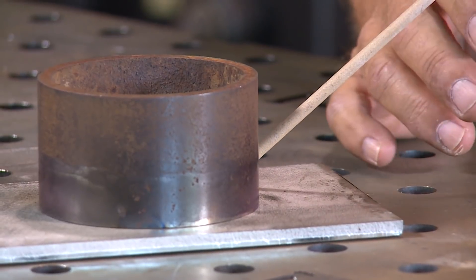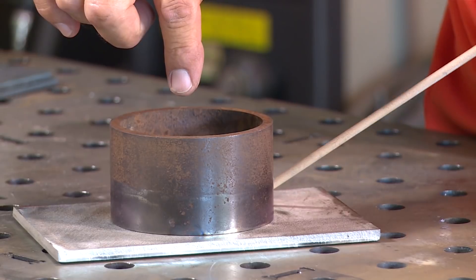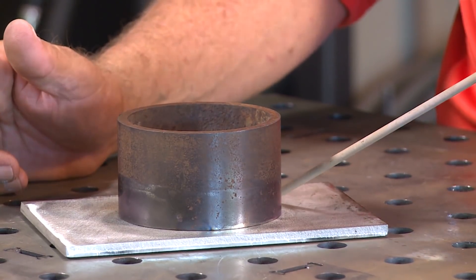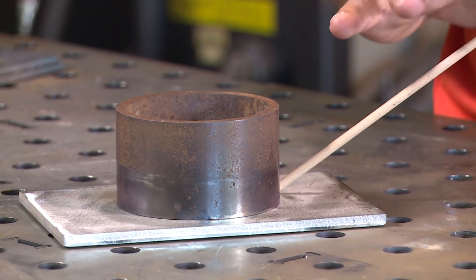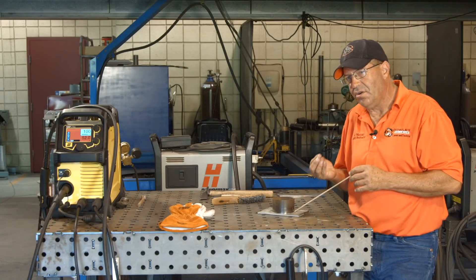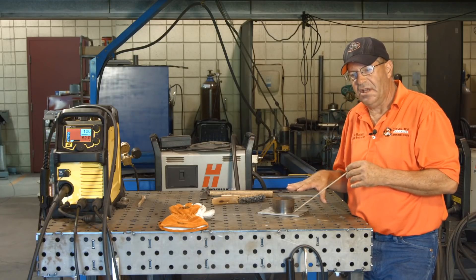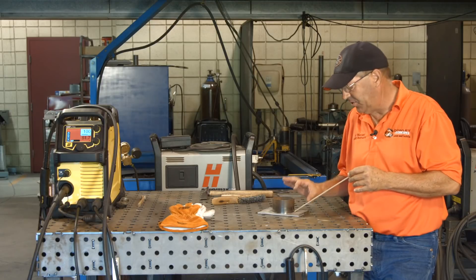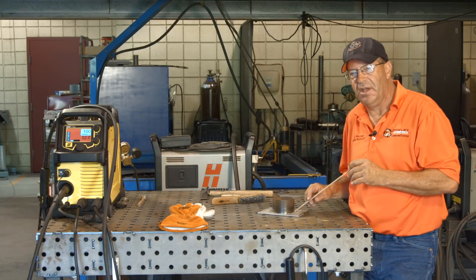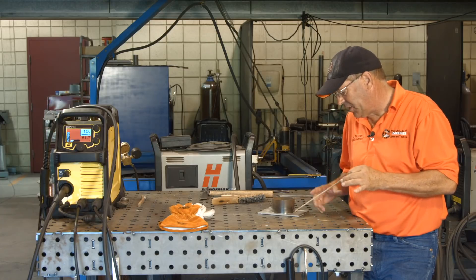I'd want to start in here, right at the center of the pipe, leaned back quite a bit. I'll make adjustments according to what the weld pool is doing, but I really want to drag it — it just makes for a prettier weld and I can control what's going on with the fillet weld. A lot of times it's hard to see the pool itself because the slag is so dense that it kind of covers up the ripple pattern. You can see the edges and a little line where the flux is solidifying behind the rod, about 1/8 to 3/16 of an inch.